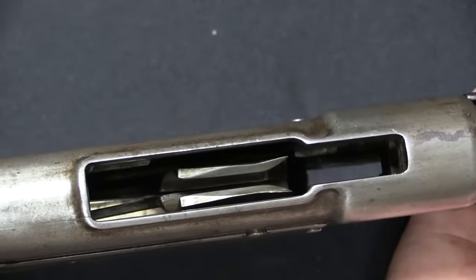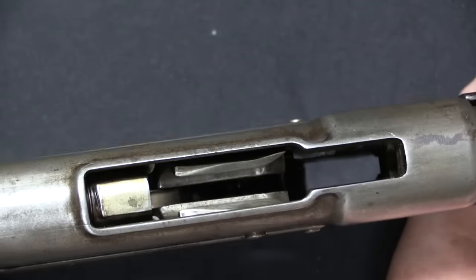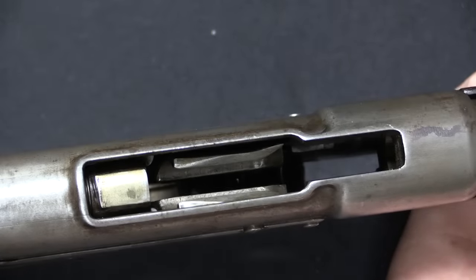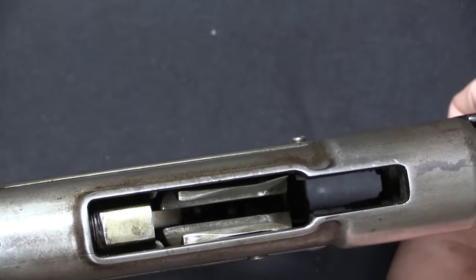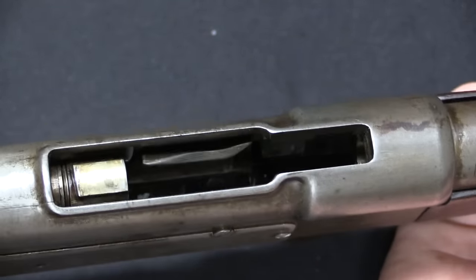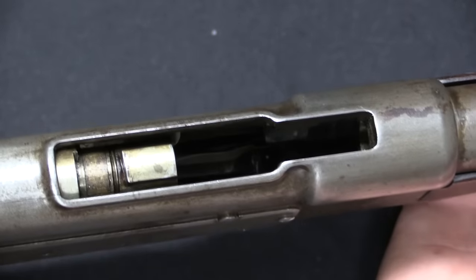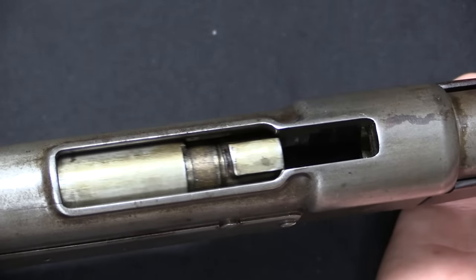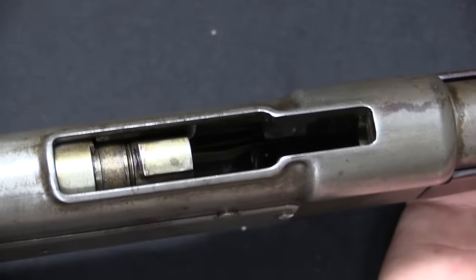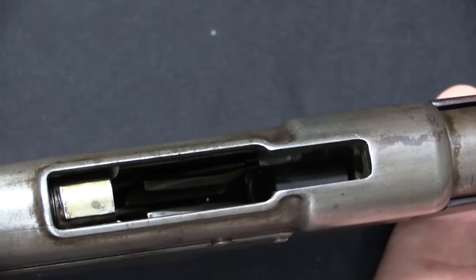And there's our elevator. When we move the bolt forward again it's going to split the elevator apart. The cartridge would be caught between the chamber at the front and the bolt at the back. Looking at this suggests this is a pretty long cartridge — I would put even money on this actually being chambered for .30-06. I have basically no evidence to go on except that this one is also .30 calibre and the action length. I'll go with .30-06.